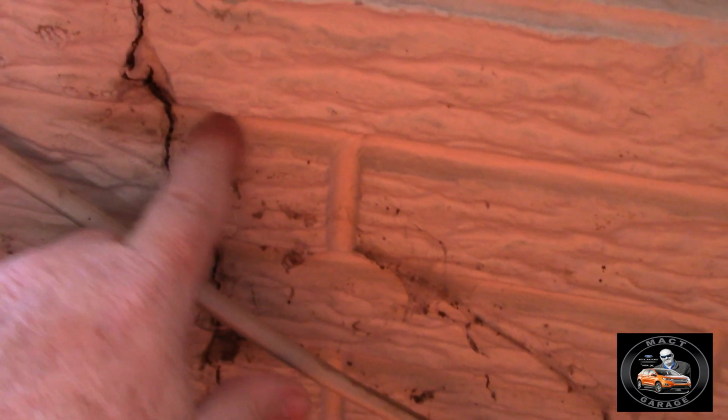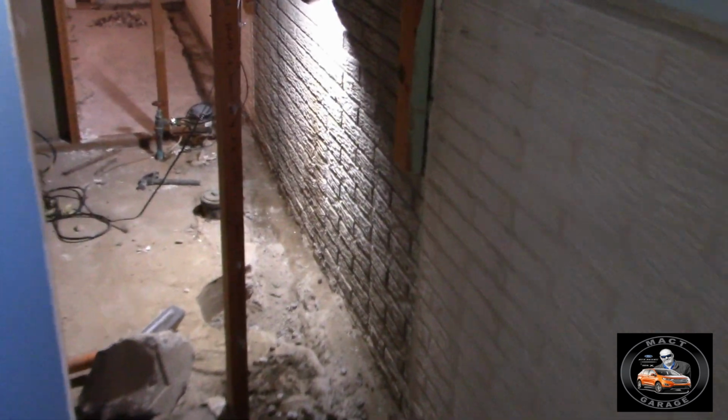And they got to fix this crack right here, and then we got another crack that they got to fix, and they're going to be doing that soon. They got to grind all that brickwork that's poured into the brick flat, so they'll grind down pretty deep into these holes to make it flat concrete to put the patches on there. And they got to do that inside there too, because there's a seam they have to fix in there. But overall, yeah, we're getting it all done.